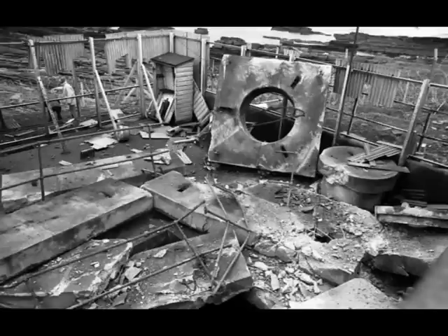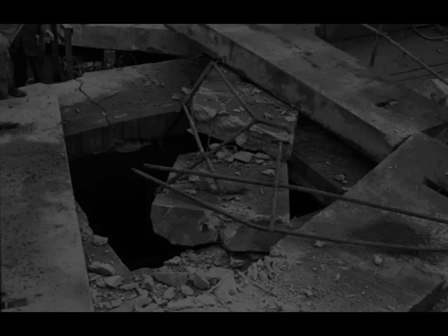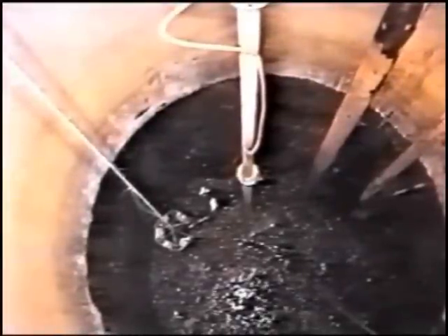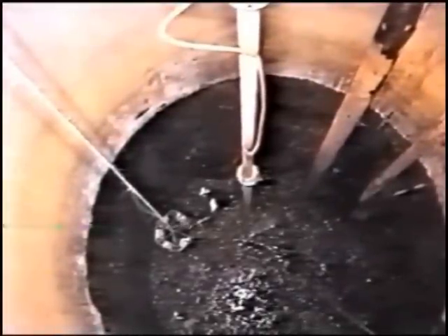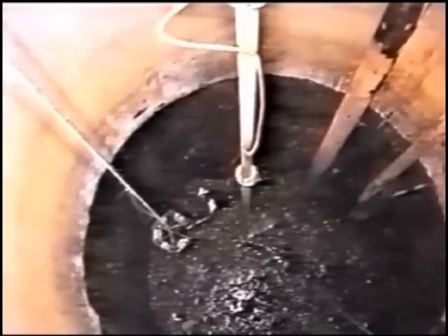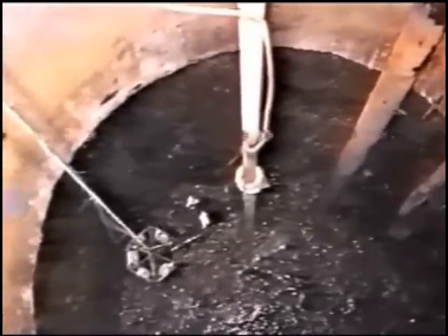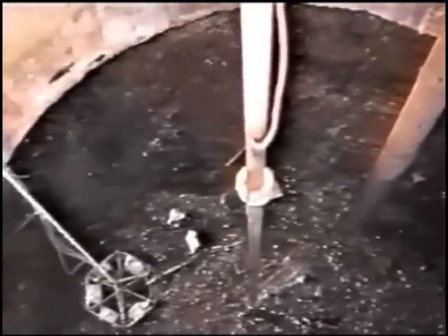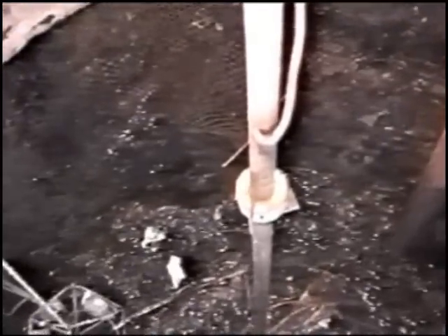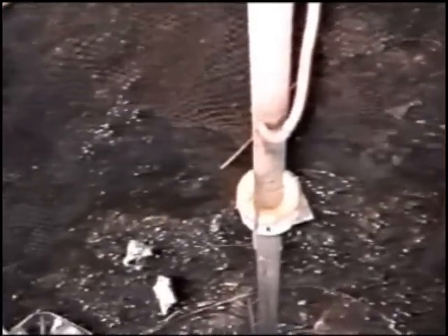The shaft is largely unlined so ground water flows in. This is a top level view down the shaft bore. The features seen clockwise are a gas sampling array, number two pump pipe, the reference, and the original number one pump pipe with its associated instrument pipe. The bottom skirt of the concrete bore gives way to the wire mesh section and on down to the lower rock.